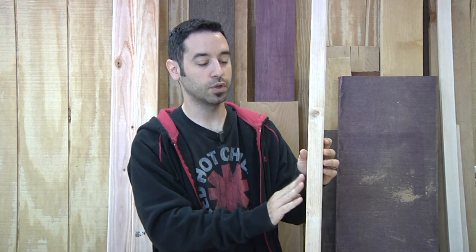The other thing to keep in mind is the total length of these boards. I like to have the back of the lumber rack made with single boards — I don't really want multiple boards for each vertical support. So get the length that corresponds to how high you want your lumber rack to be. If that's eight foot, great. If you can get ten-footers and your ceiling can accommodate them, go for the ten-footers. Just make sure they're long enough to accommodate the size you want to build.